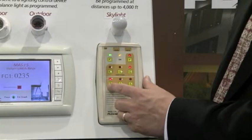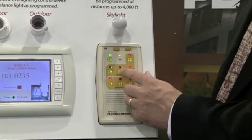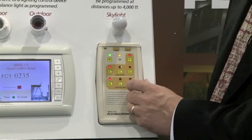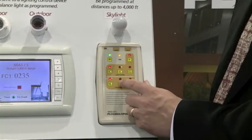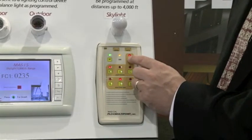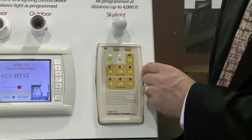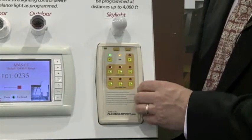The sensor also shows a zero time response. I can change those settings — maybe I want to go to a half setting on the range and change the response time. I can then hit the programming button again, and it will send those settings back up to the sensor so the sensor now operates under those new conditions.